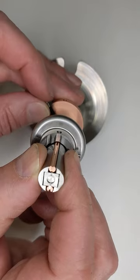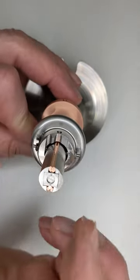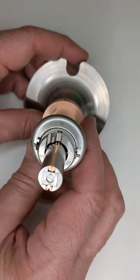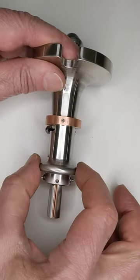The lever on the tool expands and collapses the mandrel. The mandrel is expanded for fabrication and collapsed for removal of the finished part. The slide collar is used to strip the finished part from the tool.